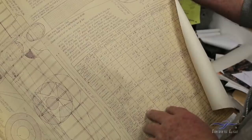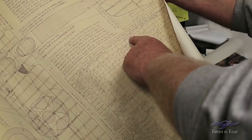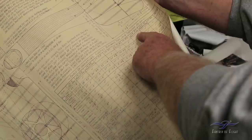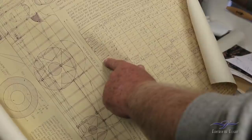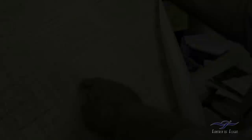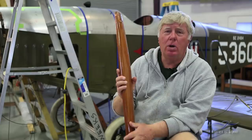This is part of the drawings — the table of variations for the different Curtiss airplanes. You can see the original prototype, the JN-4, the 4A, the production 4A, the 4B, 4C, the Canadian version the Canuck, our airplane the JN-4D, the D2, the production D2, prototype D2, 4H, and 6H. When we go down to the staggers, you can see they had different staggers. The original prototype had a 10 and 3/8 inch stagger. Our airplane, the JN-4D, is the 16-inch stagger. We had 12 inches, so we're trying to figure out why. With a little digging, we found out that the cabane struts that we had were the wrong ones — made for a different model Jenny.